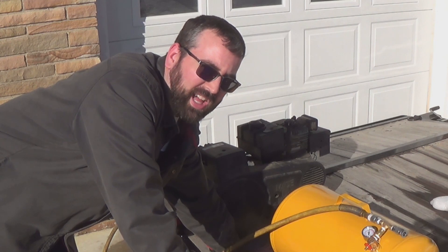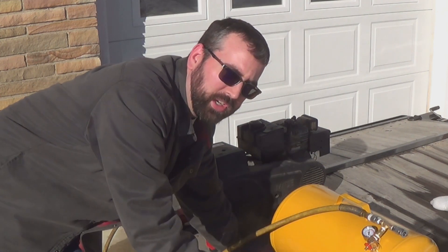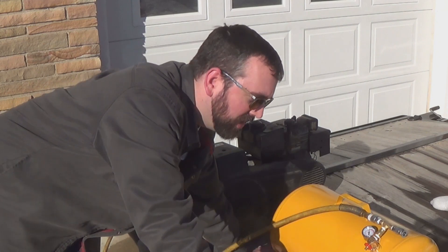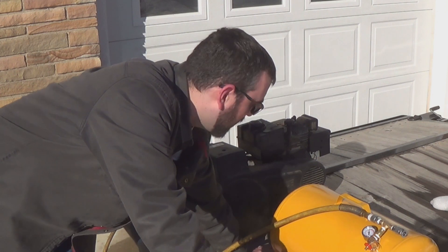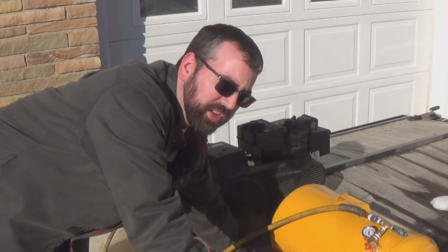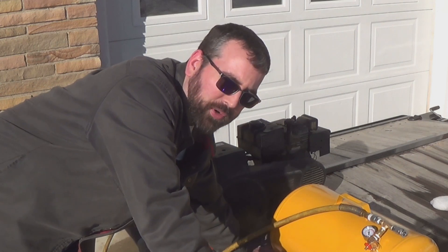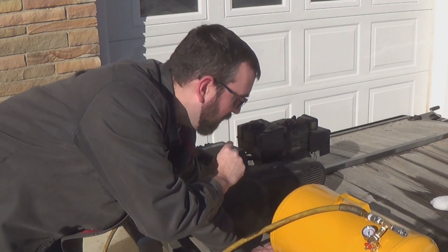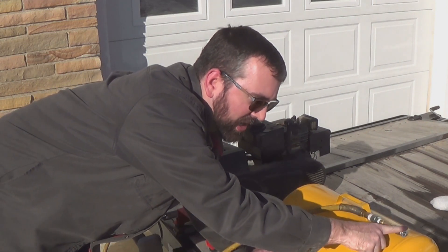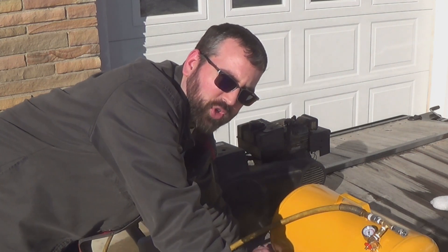As you can see, that makes a lot of air pressure even when the engine is idling at a relatively low idle setting. This tank here is working great because it has the built-in pressure relief valve — it opens at about 140 PSI and just vents air out, then closes at about 80 PSI. So if I just had the compressor running while slowly filling up some tires after off-roading and the tank pressure gets too high, it's going to blow that valve open, relieve the pressure, and keep on making more air. Overall I think it's a big success. It's a little heavy — definitely a two-person job to pick it up and move it — but with a 50 or 100-foot air line on there, we could fill up a bunch of people's tires. I think this is a really good portable solution for a group of people off-roading.